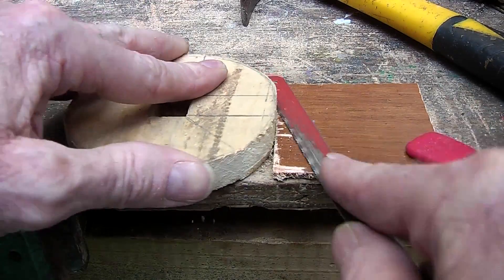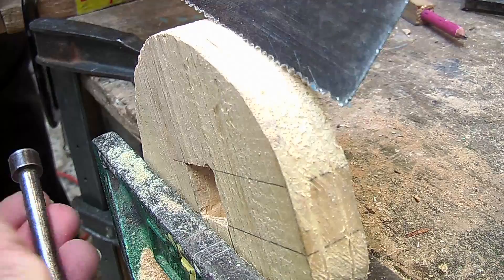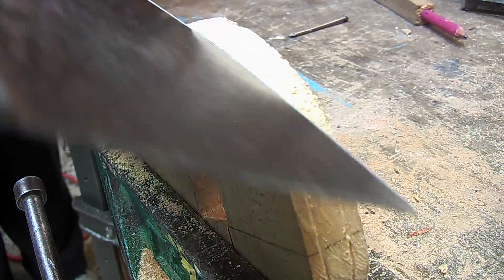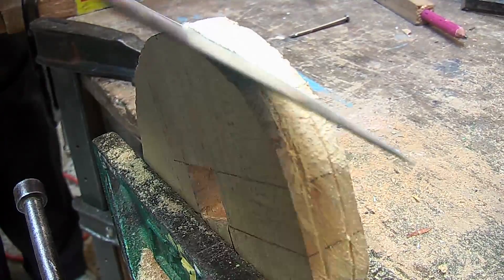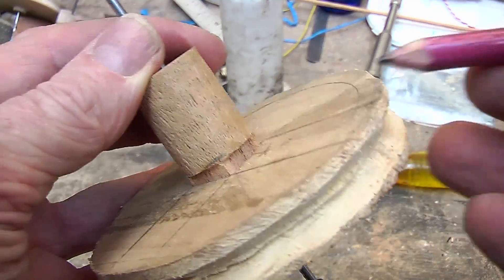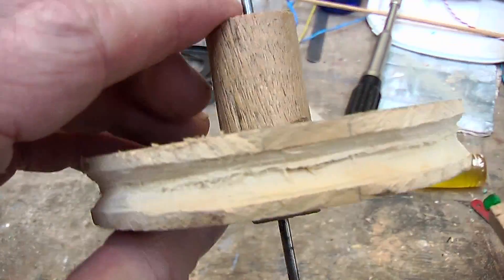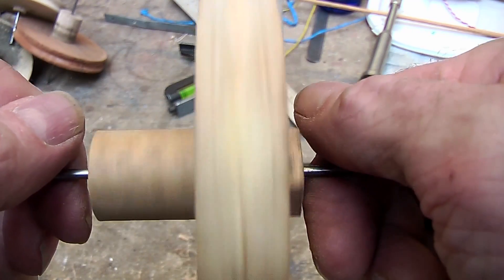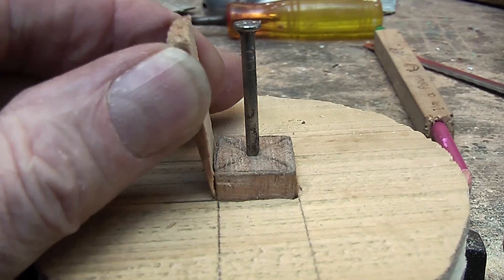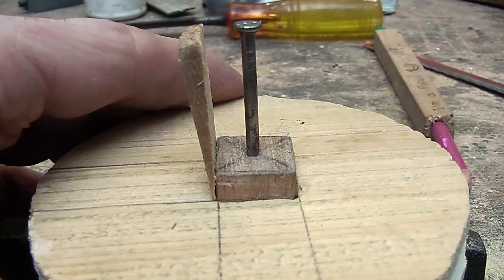Then go through the process of turning it into a pulley. If I have done this cut around here evenly, right round the whole pole, it should just click in there and then spin relatively well so far, and then we just need minor adjustments from here. Any slack that's there, I can glue and wedge a very fine wedge or two in there, just to make sure it's now going to be firm. And I will cut that off.